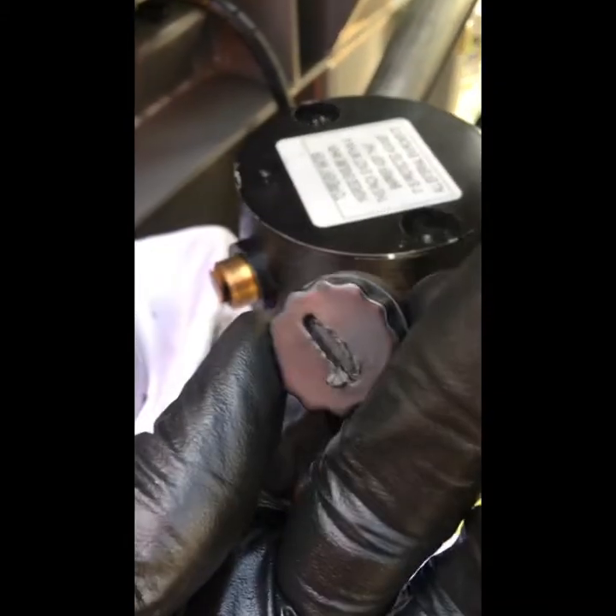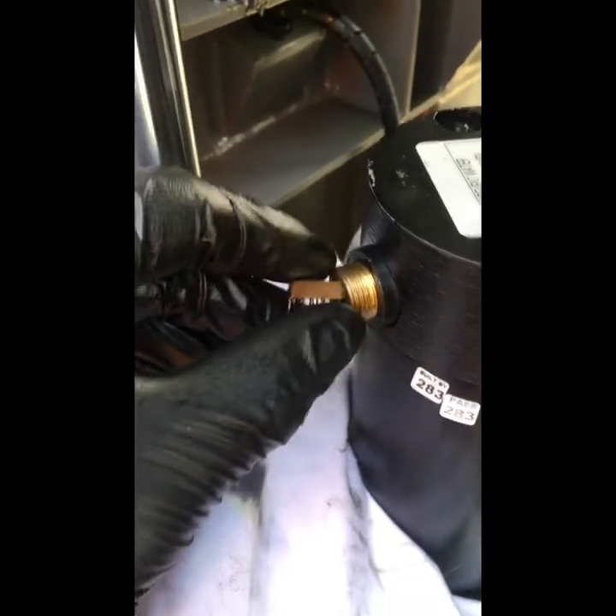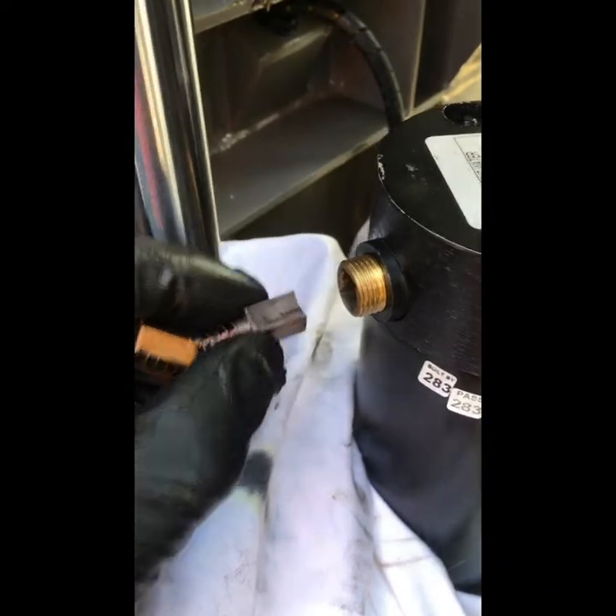These are your motor brush contacts — you can get them off by hand, they've got a grip around, and there's also a screwdriver socket, same as clamp locks. The minimum brush length is shown as 7mm. That's spring loaded, much the same way as the clamp lock — check the colour of it and make sure it's all good.